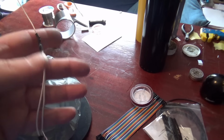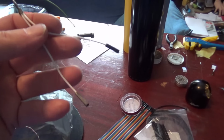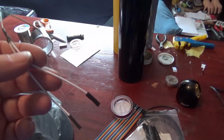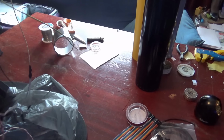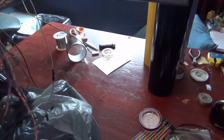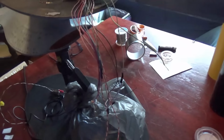What it is, I'm bringing a wire out of the main circuit board, and that wire has to plug into both the top and the bottom of the saucer, whether it's the main power or ground wire or what I'm calling the effect wires. Now I'm going to pull out the ones that go into the phaser strips because they don't get that. They get a separate, different type of joinery. But the other ones, I can go ahead and put those pigtails on.